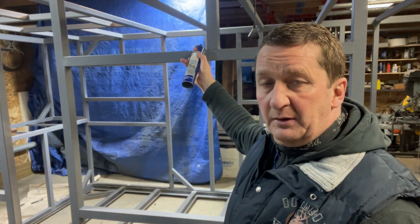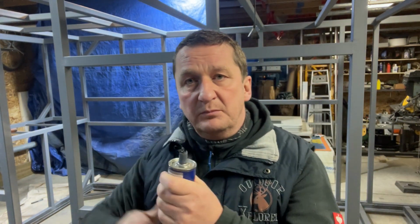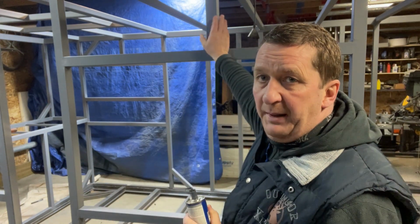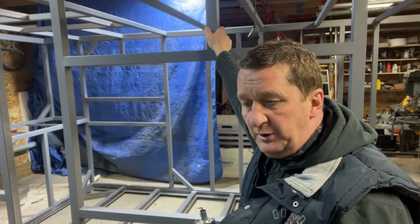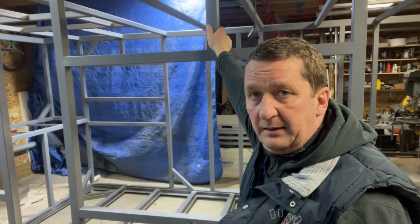I'm going to apply glue on the steel and then put the aluminum sheets against it. So Sika would say, don't put anything on there, because if you want to bond two components, aluminum and steel, with the glue in between, it's not good to bring a third one in between. It makes absolute sense, but we have bare steel here, and it will rust if there is any moisture on it, like any condensation. And we don't know that. So that's why, just as a preventative, I want to put something on there.